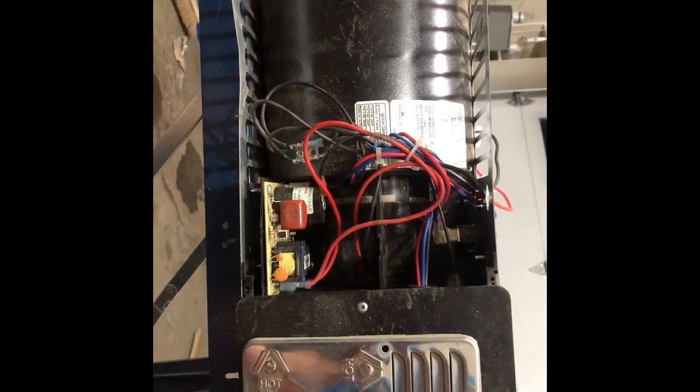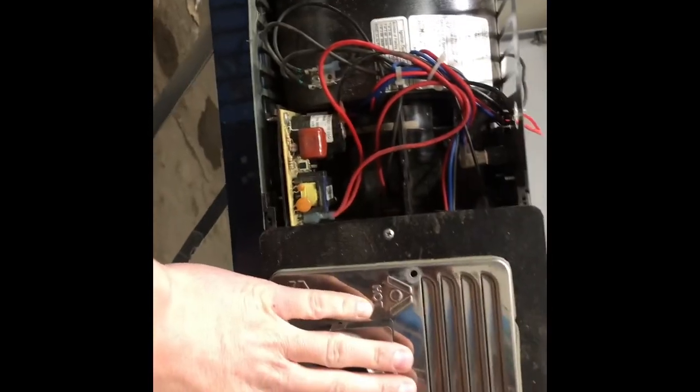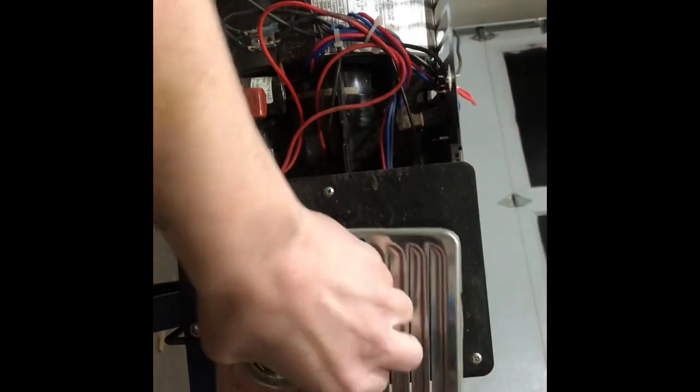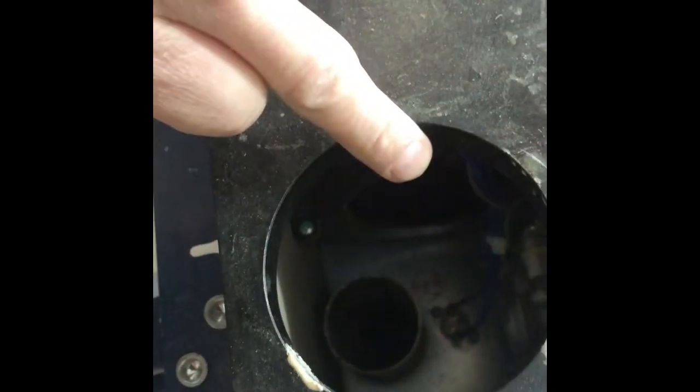And one thing to remember when you are bench testing any of these, make sure you put the exhaust back on with it running, or else it will start to backfire. Because without this in there, it shoots the flue gas out and it gets sucked back in to the combustion wheel there, and it starves it out, and it just won't run, it won't light, or it won't stay lit, and then sometimes it'll start to backfire. But we'll put that back in there for now until we get to it. Okay, so we'll start on this one over here.